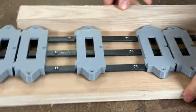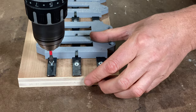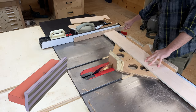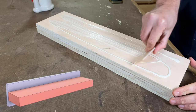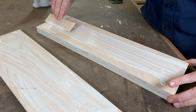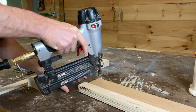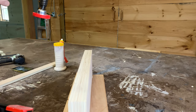I'm using the 3D printed holders as guides to hold the three bars in place while I pre-drill and drive countersunk screws to hold it all together. Then I'll cut out a little backing block — three pieces of half inch plywood glued up into a big block. This serves essentially as the other board in the imaginary glue-up, adding rigidity and preventing the original board from flexing as I clamp down from the other side. I'll add a little spacer and mount that backing block onto the back of the blue panel.